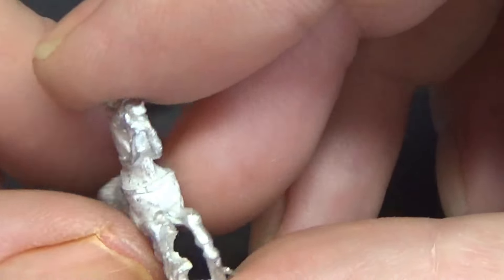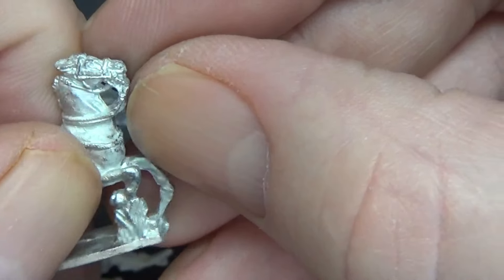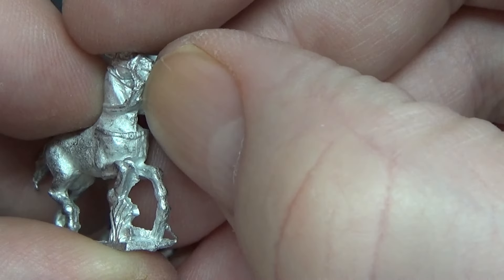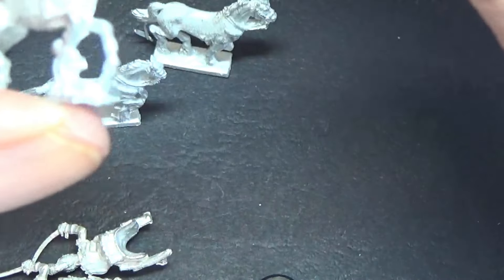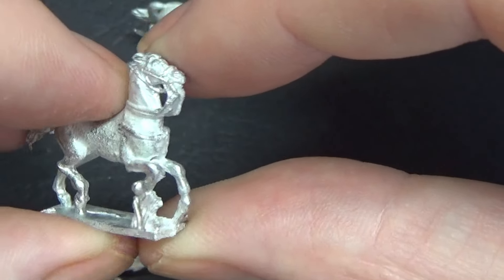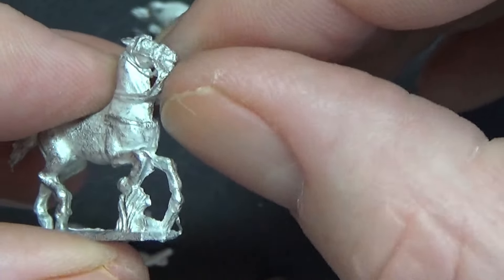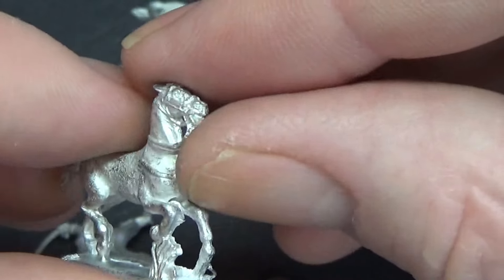I never did go on about the reins — so I drill out the reins at the front. See this infill here? They're not hard to do. What I normally do is chain-drill two or three holes in a straight line, then using a sharp scalpel — watch your fingers — just watch your fingers with a sharp scalpel, because I do occasionally slash my fingers as I miss, and give myself a nice stab mark.